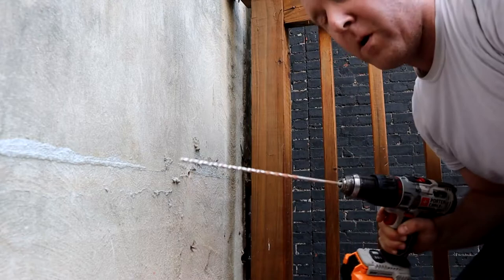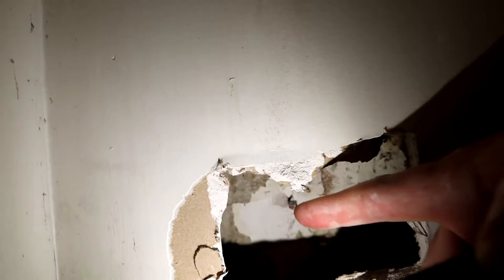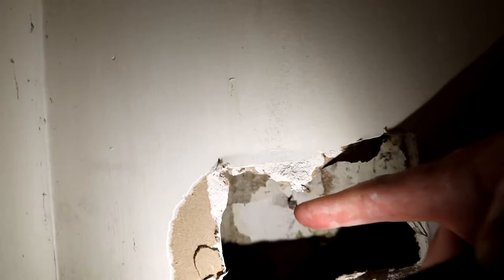So we are through. Let's go inside and see how close I was to that hole. It took me a minute to find — I stuck the drill in there, I'm not sure if you can actually see it in there. It's slightly to the left of my hole, so it is just that way, but I can see it. I was not that far off. So I gotta widen this thing up a little bit. Now you should be able to see it a little better — it's that thing poking out right there. It's set back a couple inches into the wall, so when I come in from this side with the drill I'm probably gonna have to open up this wall a little bit more to get the drill in here.